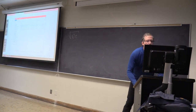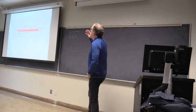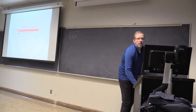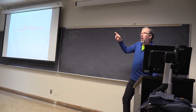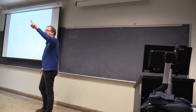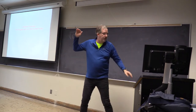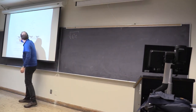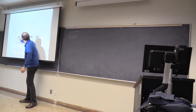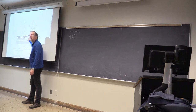And then somewhat the same goes with the beginning of this. What I want you to know here is that the oxidation, all I need you to know from the oxidation is what we talked about earlier, that the interface is virgin and that we're probably going to prefer to use the 100 substrate. Therefore this dry oxidation that we're going to do for the gate dielectric is going to be really nice with that nice clean interface. And then if we were to come in with the wet, we're going to be able to do the isolation from one transistor to the other.